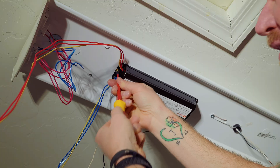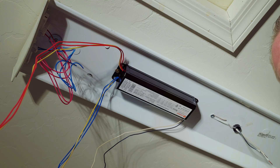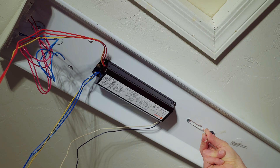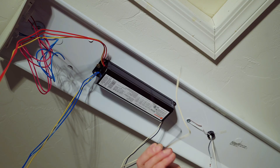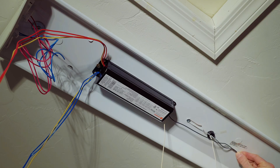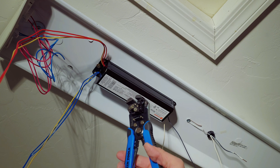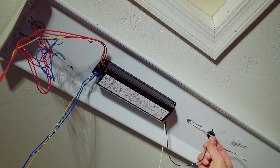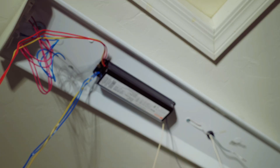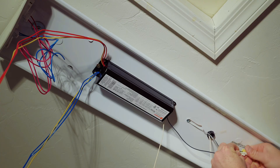We'll go ahead and tighten up the ballast. Our ballast is securely snug up against the housing, so we're ready to wire in the new ballast. I go ahead and start with my hot and neutral connections. The wires are super long on the new ballast, so we're going to have to trim those back and strip them. We'll start with the black — I like to push them over so it's not too short, giving it the longest stretch it possibly needs. Using my Klein auto strippers, I'll strip about a half inch of insulation off the new hot wire. Then using the old wire nut, we'll wire nut the black to black so the hot wires are connected.